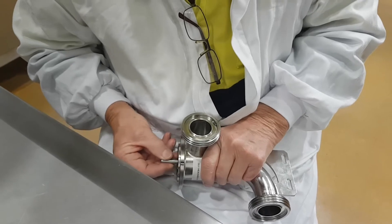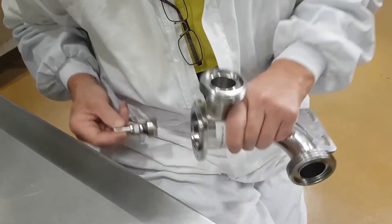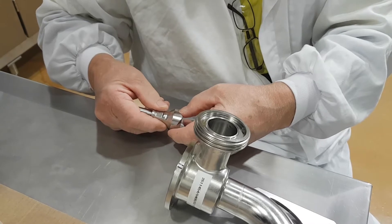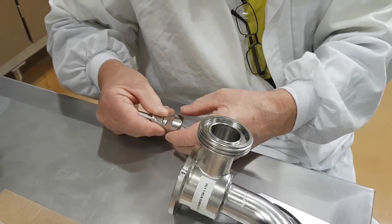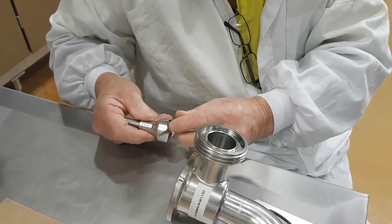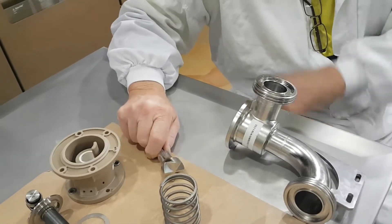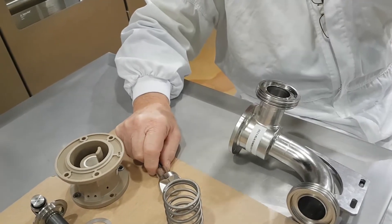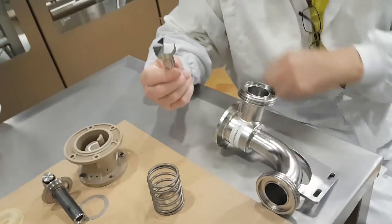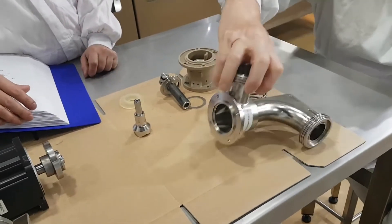You cannot see down inside the spindle. But as it comes out, some parts of the shuttle will be firstly uncovered here, but this here will still be closed. So as it moves out, we get more flow here, and more flow here, and as it moves out further, we start to get some flow here. This is for linear flow. No pressure shots, so the flow will be linear.